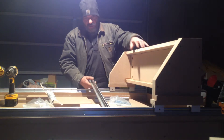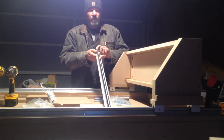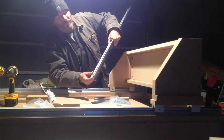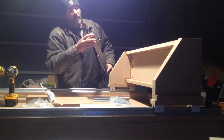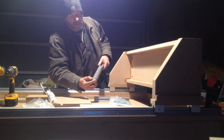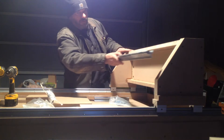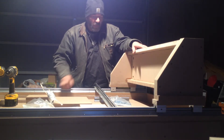So now they are a little tight. The support is all aluminum, but this is supposed to be hardened steel. I'm going to have to try to grind just a little bit. This rail here — the support sticks out about a 32nd of an inch. If I can get away with just grinding that down a little with my grinder, and this other one — that sixteenth is actually offset a little — I'll have to grind that steel down with my angle grinder. I'm not too worried about what it looks like, as long as I can clean it up and get my bearings on good. As you can see, it almost goes, so there's not much I have to take off.